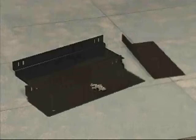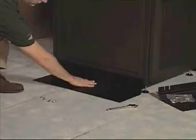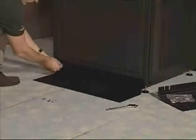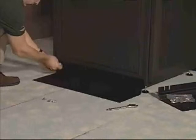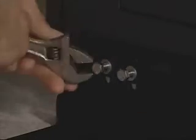For a standalone rack, stabilizing feet are required for additional support. Rack 7142 and 4136 units require one kit each and need to be ordered separately. Each kit contains three stabilizing feet. Align the stabilizing feet with the holes on the bottom of each corner of the rack. Attach one to the front and one to each side of the rack. One stabilizing foot is included with the rack 7122. Attach it to the front base of the rack.